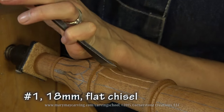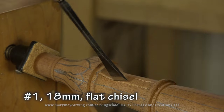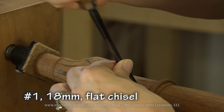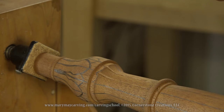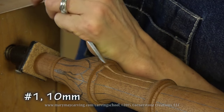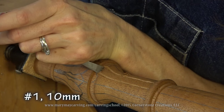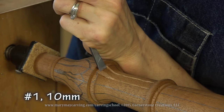This is where I really don't like to press back on myself, but it's the best view from the camera. I'm going to step away from it because on this project it slipped a little bit sometimes, and I don't want it to damage me or the wood, so I'm pressing lightly. Now I'll go back with this 10 millimeter flat chisel and go right down into that, rounding this surface so it creates a nice little scalloped edge.